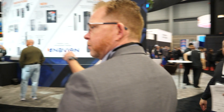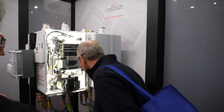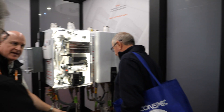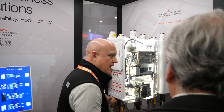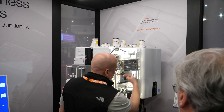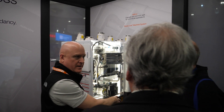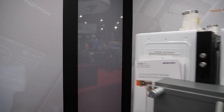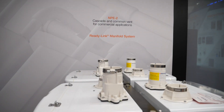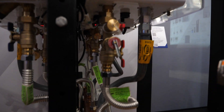We've got a demo here showing our tankless water heaters on a rack system — all of that is currently available, we've had it a couple of years. One of the nice features for commercial applications is our common vent capability. At the top of those units, the exhaust collar is actually a little bit taller than the intake. We can actually common up to 12 of our water heaters together using one intake and one exhaust for the entire system. By having them staggered like that, it makes it easier to do the common venting so the pipes aren't running into each other — elbow it forward, elbow it back, depending on wherever you want to get that vent pipe.